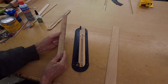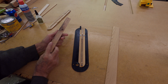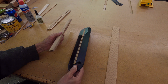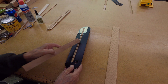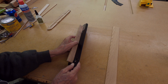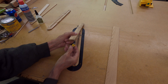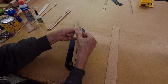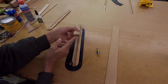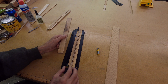I started out with a piece of hard maple scrap and first planed it to exactly the right thickness to fit in the slot. It fit just perfectly — you don't want it too tight because it'll spread the slot apart and warp the plate, so it's got to be just the right fit. Once I did that, I used an eighth-inch roundover bit on the ends across here, rounding both sides of each end, so now I've got little rounded corners on each side at both ends.